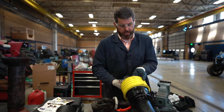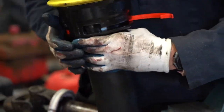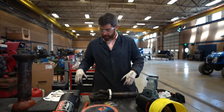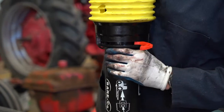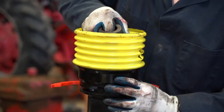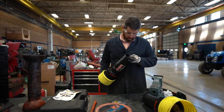Slide the shaft down through the shield, making sure the bearing sits in there really nicely, then lock it down with your tabs. Do the same thing on the other side — come from the top, make sure that bearing sits in there, lock in the tabs, and now we can align our PTO shaft together.